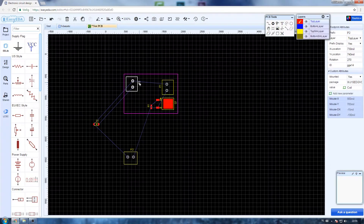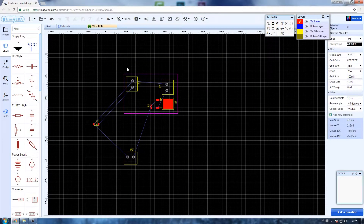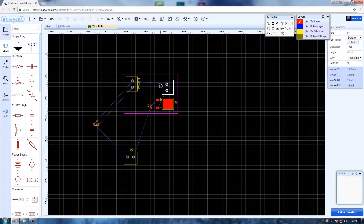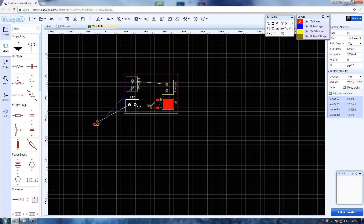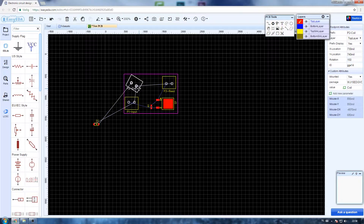While you can see the process in the background, let me explain how this works. You have to attach three magnets to each end of your fidget spinner and make sure it's as balanced as possible. The PCB only consists of three real components — the MOSFET, coil, and reed switch. Every time a magnet crosses the reed switch, it will get triggered and allow current to flow through. The switch triggers the MOSFET, which creates an electromagnetic field around the coil. The magnetized coil then pulls the magnet toward itself, which means the magnet moves away from the reed switch. This way the MOSFET switches off the current supplied to the coil and the coil demagnetizes again. Since there is a spinning motion going on, the following magnet will cross the switch and the process starts all over.